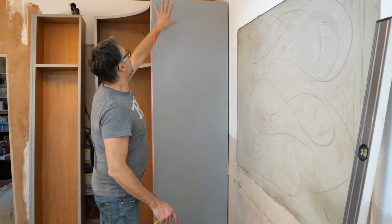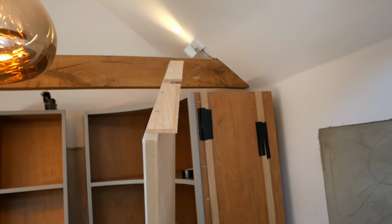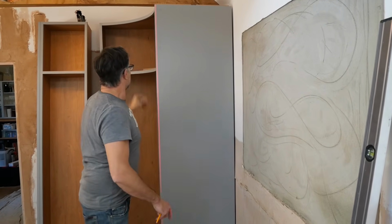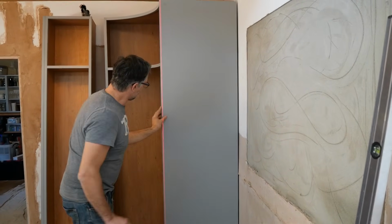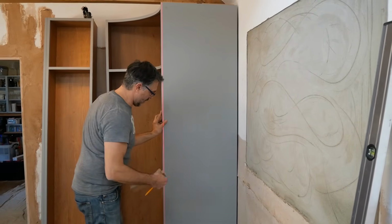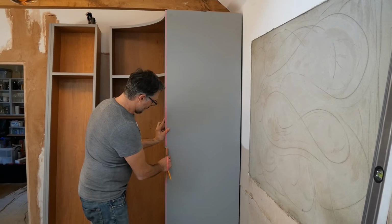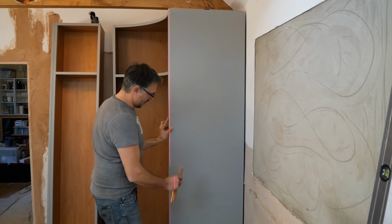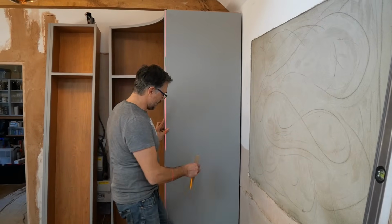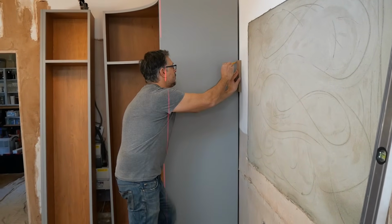Right, another way to scribe. We hooked the panel on top there, and let's put some 6mm pieces there, so it basically is sitting on top of the unit, so it's going to be nice and flush. We've got it to the front of this unit, so we know this. We want this to step back 22mm, which is the thickness of this frame. So, sitting it there, flush to the front, that would be the frame in the front there. Got a laser level, just to make sure the panel is level. And we can just use the block and run it down the back.